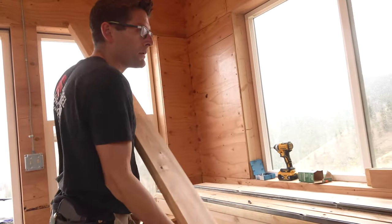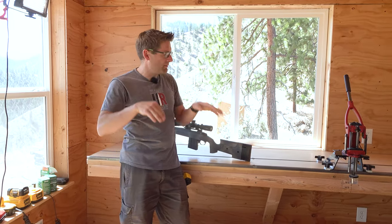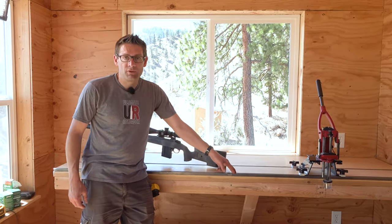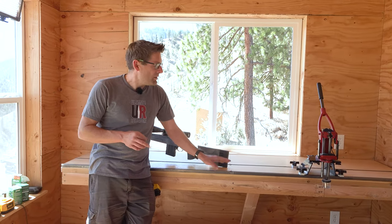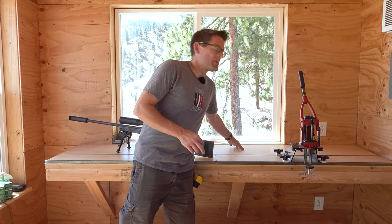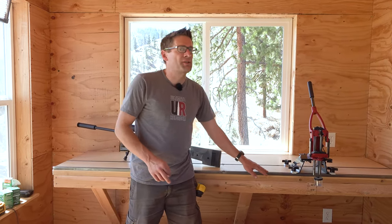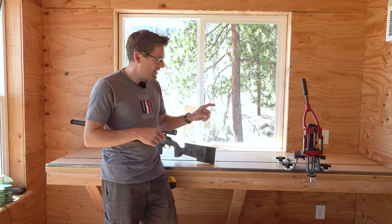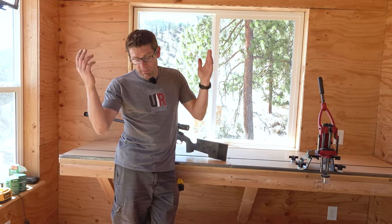I've got 2x6s — four of them going back. You could use wider boards but 2x6s will exhibit less cupping, which is really important because they're the substrate for the top, which is 3/4-inch plywood. These are 3/4 by 3/4 steel tubes that have been cut with slots, countersunk, with attachment points on the end. When you lay the tracks down on your tabletop you can pop 3/4-inch plywood on either side and have a nice level surface. I've got wood strips that slide into the screw head slots and plugs that fill them — once those plugs are in place you've got a nice smooth surface. You're not going to have cartridges, pens, or primers falling down. You can use a brush to wipe all debris off your bench top onto the floor and sweep it up.